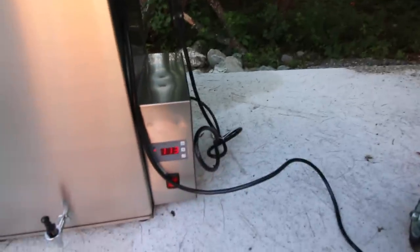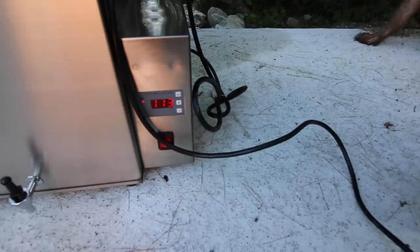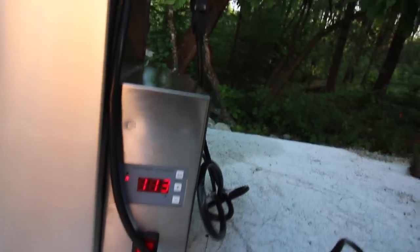Let's go check what temperature the scalder is up to. It's been about 50 minutes and it's up to 113°F — when we started it was 53°F, ice-cold well water. They do make a 240-volt scalder, but this is what I was thinking: the average person is going to have 110 volts to plug into, so it takes longer this way. 240 is about half the time, but if you want to go butcher somebody else's chickens at their place, it's going to be a lot easier for them to have a 120-volt plug. And if you're off-grid, you can use a generator.